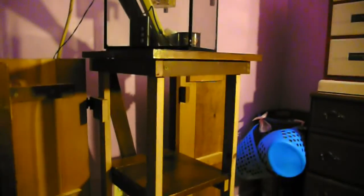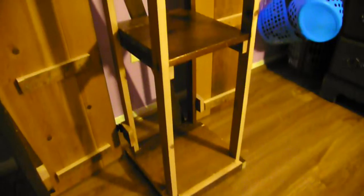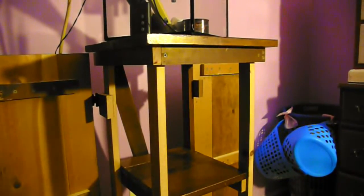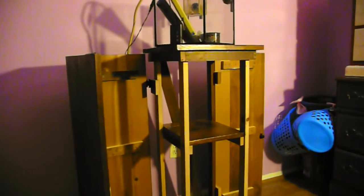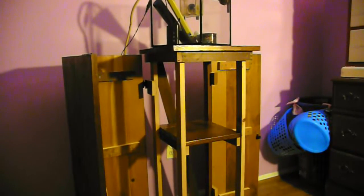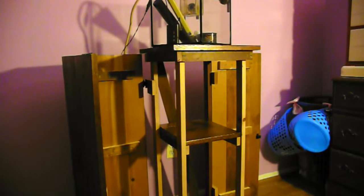I liked the shelf because I had a lot of space to work, and I wanted to duplicate that workspace but also make it look nice. I made it out of beams I cut from solid wood that I just found lying around. I refinished the wood — I didn't even sand it. The technique I like to use is: clean the wood down with paint thinner, apply a stain, then spray the wood with a little black paint and rub it into the grain using a towel with paint thinner on it.